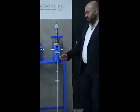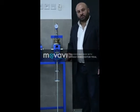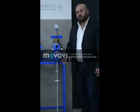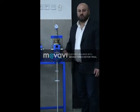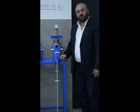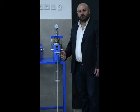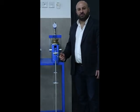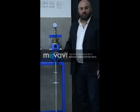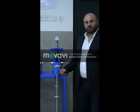After that we take the reading again, increase the weight — we double the weight — and again we start the same procedure with a timer to track the change in the dial gauge reading. We take readings at the same increments: half a minute, one minute, five minutes, etc. With that we will be able to draw the graph and show the behavior of the sample under different weights and how the consolidation is happening.